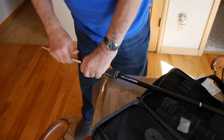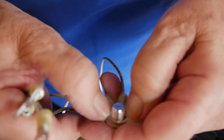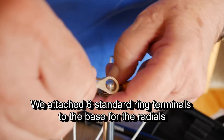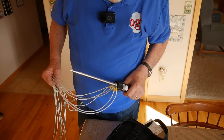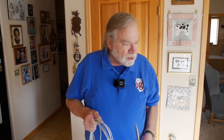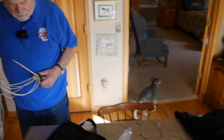The radials go down at the bottom, where the ground stick is. Undo the radials from the keeper and see how many we can put on. I can't put on too many or there won't be any thread left — this is why you may want to create your own base using a somewhat longer bolt or screw. So we'll spread out the radials, pull the others off, and set this thing up. We'll fully extend the whip and see where it's resonant before we start doing anything. There are two adjustments: the slider on the adjustable coil made of stainless steel, which introduces some resistance, and the whip on top. I'll meet you outside.